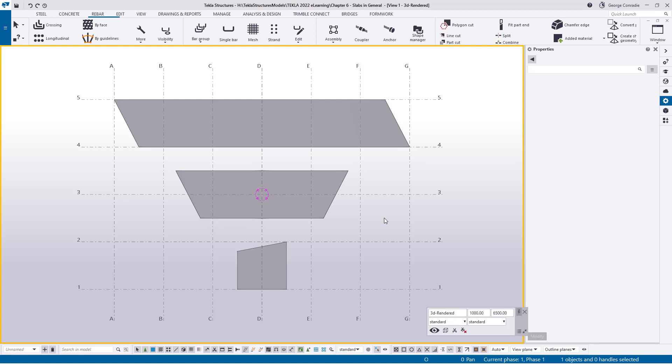In this video we're going to be looking at tapered ranges, specifically on splitting and optimizing tapered ranges so we can reduce our number of rebar within our bending schedule. I've got three arbitrary slabs: the first one introduces us to the tapered range and the split and optimization of the split; the second one shows how to optimize bars in a dual tapered range so they come out the same; and the third one we'll split into two sets of stock bars and optimize the remaining tapered bars.